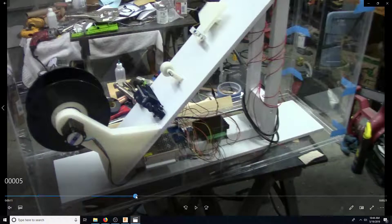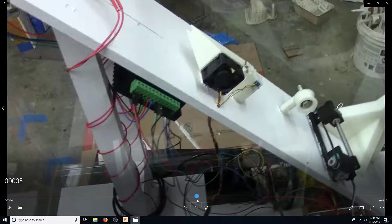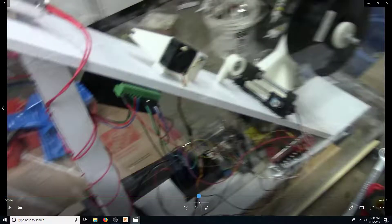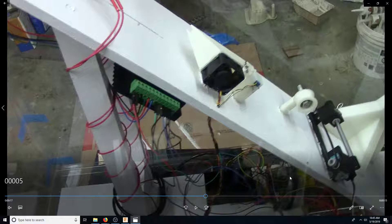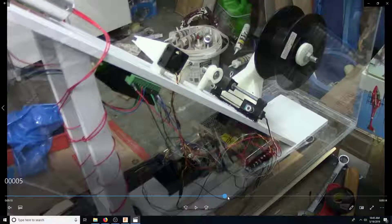On the other side, underneath, there's a dual H-bridge which I originally tried to run the stepper motors off of, but they're way too big for it so it started to get extremely hot and would eventually start losing steps. I'm using that to regulate 12 volts down to 5 volts, because putting 12 volts into the Arduino and relying on the internal voltage regulator is a little scary. That guy also sends power to the servo, but in actuality the servo will probably run on 6-7 volts to keep the torque high.